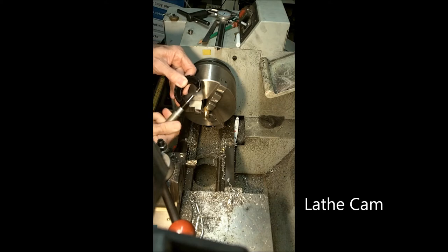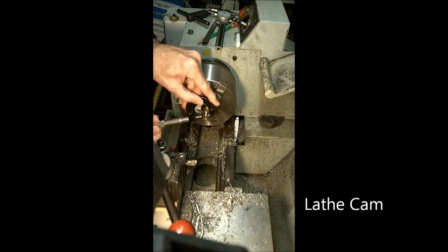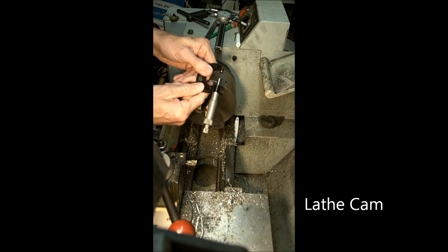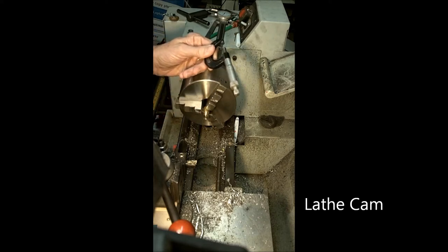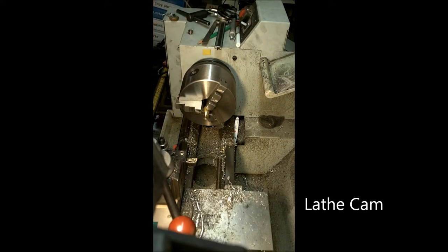If you don't know how to read a micrometer, it's really easy — I encourage you to buy one. This happens to be a Starrett. You don't need to spend as much money as this; actually, this was my dad's micrometer from his shop. The ones I buy are the little Chinese micrometers. We're now at 503 thousandths. So 503 minus 496 — I've got to go 7, divide that by 2, three and a half more thousandths. I should be right on the money.